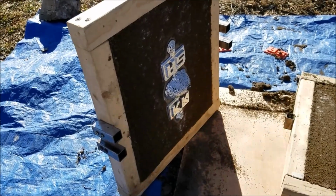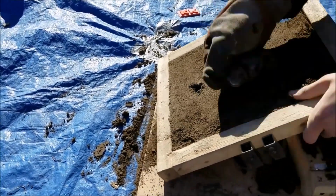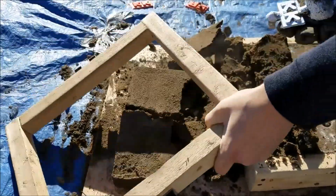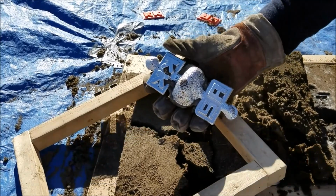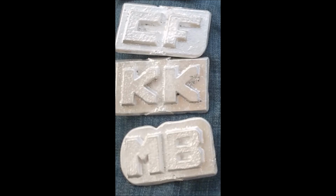Once the aluminum has solidified in the mold, I can remove it from the mold and recollect the sand for future use. With an upright bandsaw and a grinder wheel, I remove the runners and exhaust from the initials and sand down the connections to be flush with the rest of the piece. This process took many iterations to get right, but the hard work has definitely paid off, and it turned out to be a great gift for my teachers.